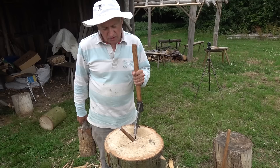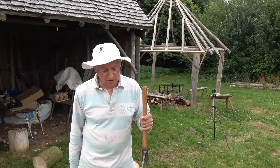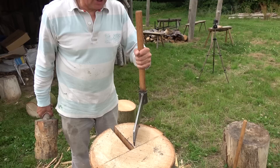You can cut up to a couple of years and the moisture stays in the wood — it might dry out on the edges. With chestnut, because it's durable, I tend to leave it laying in the wood, or if I've sourced it, leave it in the shade so it doesn't dry out too much. It's worth trimming off the ends because the end grain dries out and can have a few splits in it otherwise.